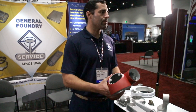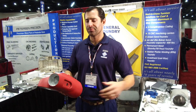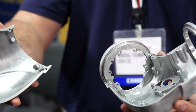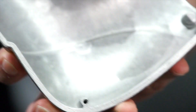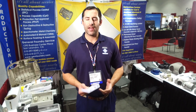We made this geometry in our rubber plaster mold. Plaster will give you very similar characteristics to die casting, but at a fraction of the cost as well as a much quicker speed to market. Here's another great rubber plaster mold part — very thin-walled, very smooth surface, as you can see. We'll pour down to two millimeters. We'll try to convince you to make it thicker, but two millimeters is about the minimum. You can see the fine detail involved, and the mating surfaces are all as cast. This is a great example of really maximizing the value of the casting.